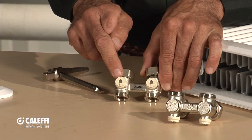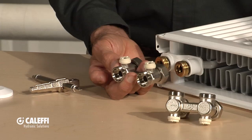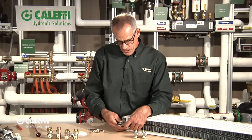As you notice, it has two screws in it — those are isolation valves, ball valve shutoffs. That same radiator tool typically has a screwdriver end that fits in there perfectly, so you can turn the supply and return on and off. That isolation valve lets you shut both off so you can remove the radiator from the wall to paint behind it or during rough-in.